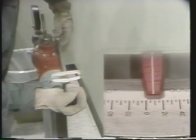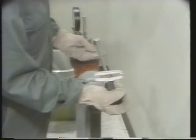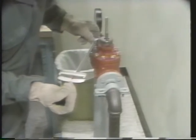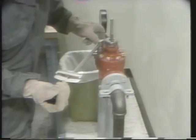For this valve, the first torquing stage is approximately one-third of the required torque. Since our desired final torque is 30 foot-pounds, our first wrench setting is 10 foot-pounds. In addition to torquing in stages, it's important to follow the required torquing sequence so that pressure is applied evenly — this prevents warping of the gasket. We'll use the same criss-cross pattern used when disassembling the valve. The technician will torque in three stages, applying approximately a third of the torque each time.